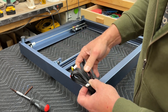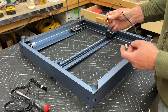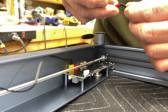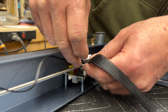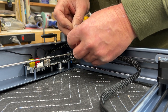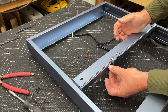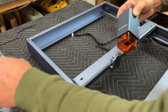Next is the wiring, which is very simple — it's all color-coded. The yellow plug goes in the yellow slot on the circuit board and then runs straight over to the Y-axis stepper motor. Then there's one other wiring harness with a red plug and a white plug; they go onto the circuit board — one goes to the X-axis stepper motor, the other powers the laser head. The little thumb screw holds the Z-axis for the laser head; you adjust the height and then tighten it down with that thumb screw. There are holes along the X-axis to zip-tie the wire into place.